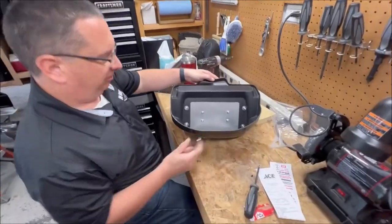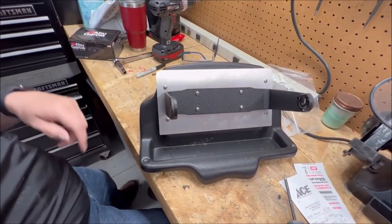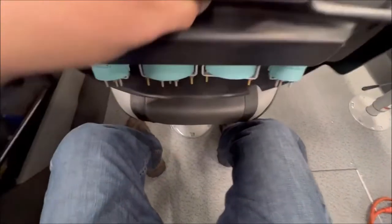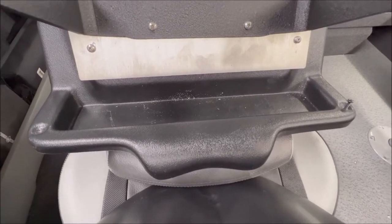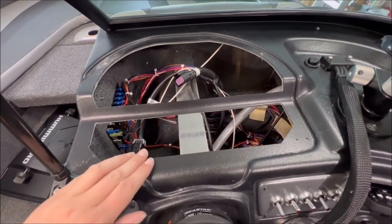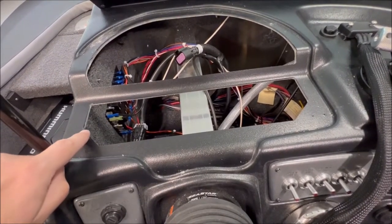Here's what the back looks like with everything tightened up. An observation: the tray on the old unit is shorter than the tray on the new bezel. You'd think that's no big deal, until you realize it doesn't sit on here exactly right — it sits well in the back, but the front has a gap I need to overcome. It looks like these little corners will need a cutting wheel to trim a little bit out to accommodate the larger tray.